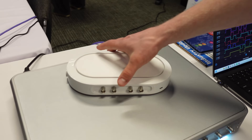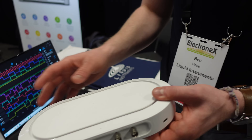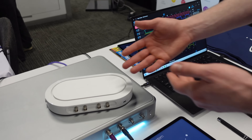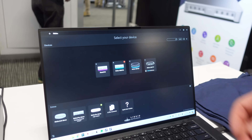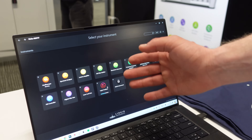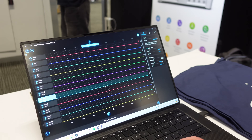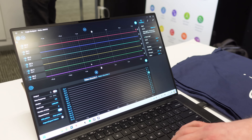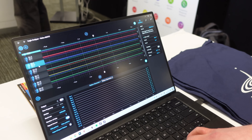I notice you've got a digital logic analyzer here. How does that work — you've got no digital inputs? We've got the Moku Go, which is our entry-level one, which comes with digital signal in. You can link it to your Pro or your Lab, and it basically allows you to have digital triggering or digital output signals over Ethernet. You can stack devices on top of each other on the same control device. With the logic analyzer, you can create signals by adding ones and zeros in whatever pattern you want, with multiple configurations and 16 individual bits.